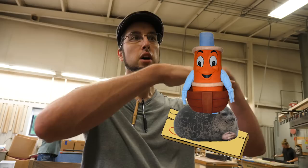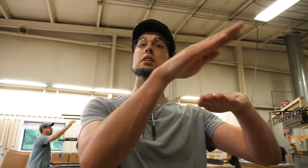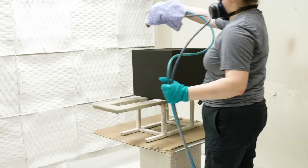We're gonna talk about how terrible espresso is at scuffing. After it gets stained, whether it's stained or natural, natural goes: wood, seal coat, scuff, top coat. Stain goes through the same thing, only there's an extra staining step — so it goes: wood, stain, seal coat, scuff the seal coat, top coat. Because if you just sand it, you'll sand the stain off. So you've got to seal it to seal the stain in.